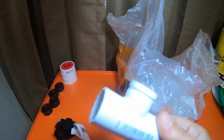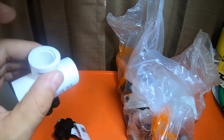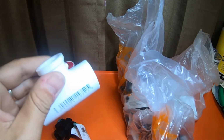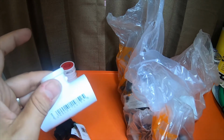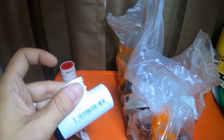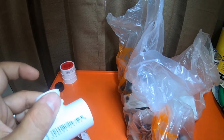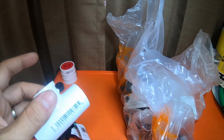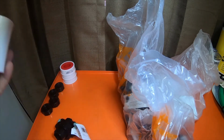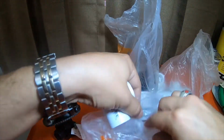To me that seems like a lot of tubing and a lot of sizes, like 3/4 PVC to 1/2 inch threaded coupler, and the other side would be a 1/2 inch barb fitting, or either a barb fitting or 1/2 inch shark bite to 1/2 inch irrigation black tube. Then you would poke your holes in that 1/2 inch irrigation tubing for the 1/4 inch nipples. For the 1/4 inch tubing, to me it just seems way too complicated. It doesn't need to be that complicated.